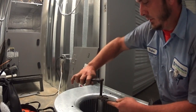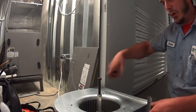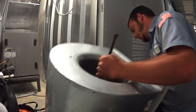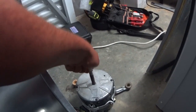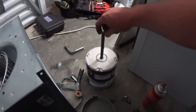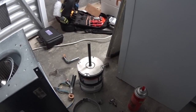It would actually be nice to use a vice grip to hold on to your backup and your drive bolt so that you didn't have to worry about them falling off, but you make do with what you've got. And she lifts off — pretty straightforward. We've got the motor pulled and she's tight, not free spinning like she should be. So we've definitely got issues. Got a nice smooth shaft movement.